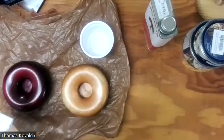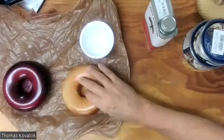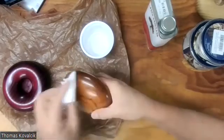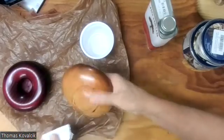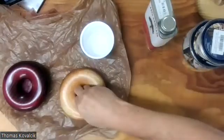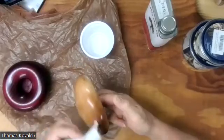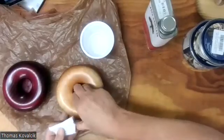I'll let it soak for at least 15 minutes, but I'll check it in between, especially like cherry on this end grain, it's gonna soak in pretty quick. So I'll let it sit for about 5 minutes, come back, check it. I wear gloves too, by the way. Put some more on the dry spots and let it soak wet for at least 15 minutes.